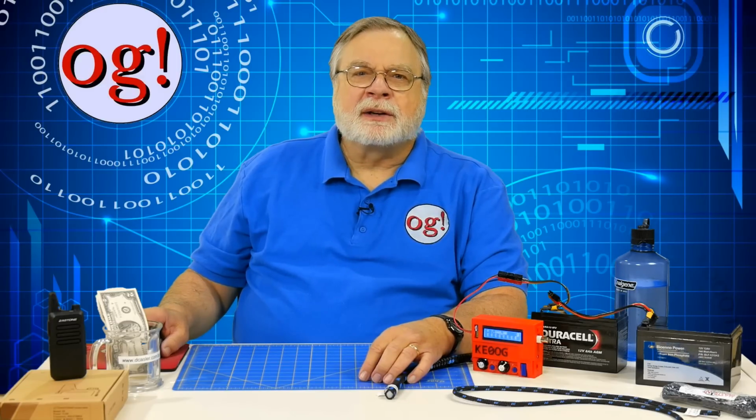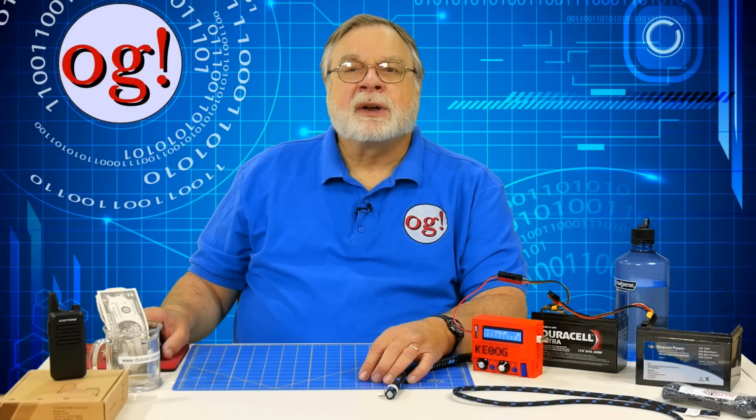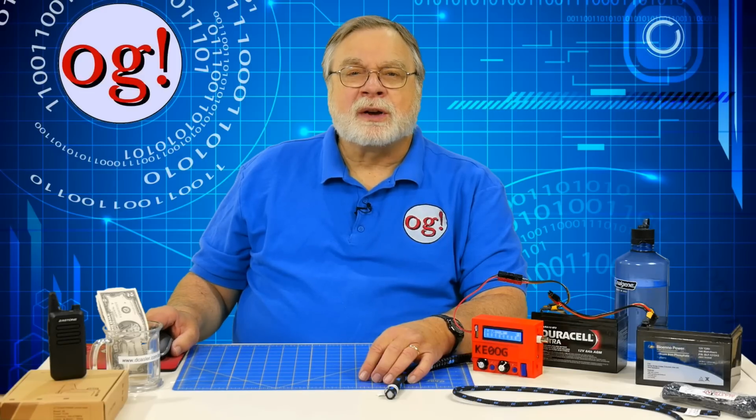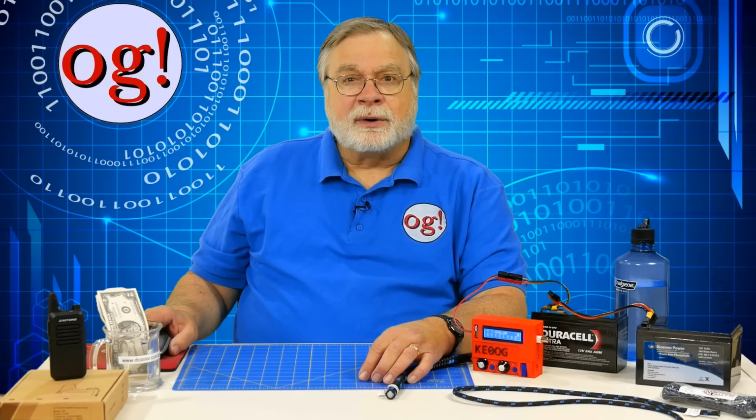These are problematic devices if used on the family radio service frequencies, as they put out too much power. GMRS is okay, but requires a license. Operation on other frequencies is problematic and likely illegal. However, they operate on the ham bands just fine.